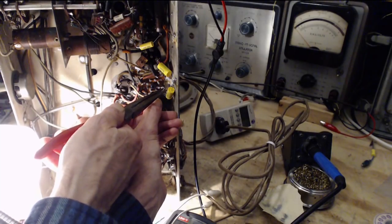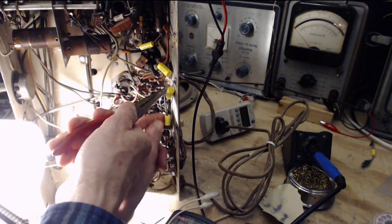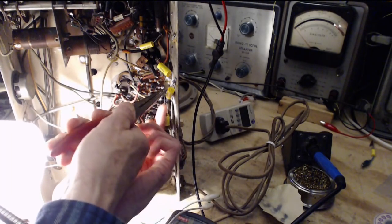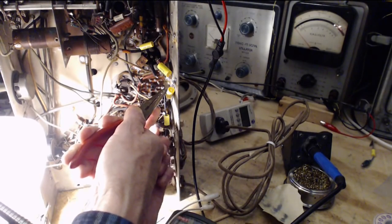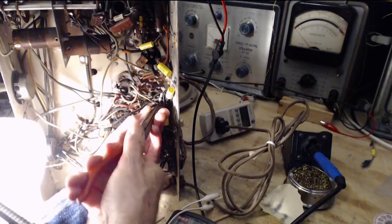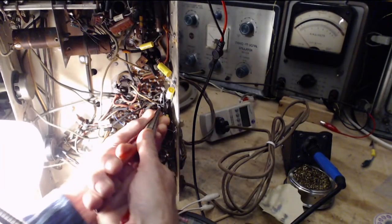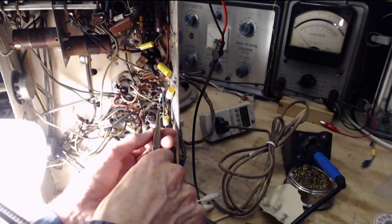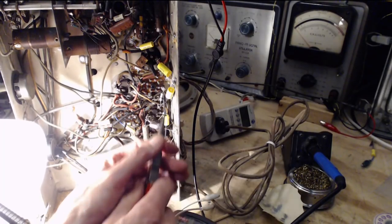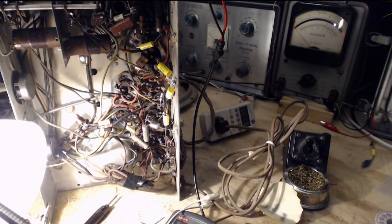Normally I would deal with resistors after doing all the capacitors and doing voltage tests to try to find bad resistors. And that's kind of what's happened here, isn't it? How did this radio work at all? Maybe bad capacitors failing to stop the progression of signals in the radio that you don't want to progress, and bad capacitors letting a signal somehow get to the speaker through some alternative path in the radio. Does that make any sense? Like traveling on the AVC line or something like that. I don't know if I'm really making a lot of sense with that, but